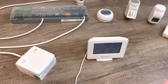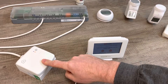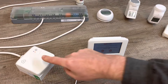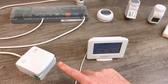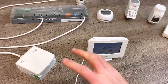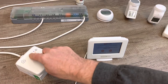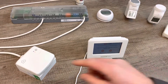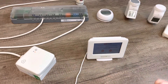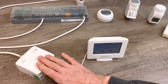When you buy a connected thermostat pack, you will get an Evo Home controller, a desk stand, and a BDR91T. The latest Evo Home controllers come with the T-series relay, which has got the house symbol on it. The T-series relays were launched because they are now compatible with heat pumps. The older BDR91A relays don't have the house symbol, and they will not work with heat pumps — these newer relays here will.